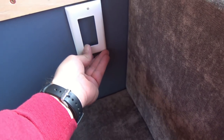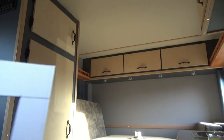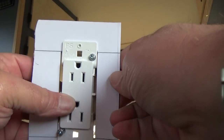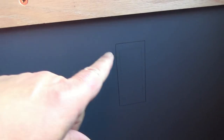We need to find a place to put our switch — probably about right here. I'm using a template: I measured the width and height needed for the hole and cut out a little template to fit. I'll set it up, scribe my lines, put some tape around the area, drill my holes, take my jigsaw, cut that out, and then install the switch.